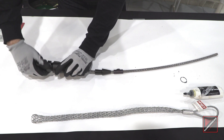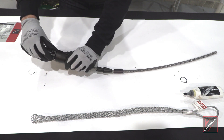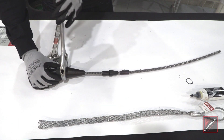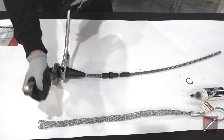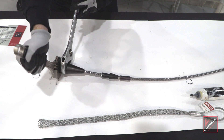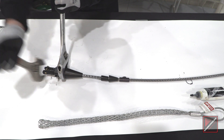A lot of guys in the field like to just hand-torque this — I highly do not recommend that. You do want to get two wrenches on this and torque it down until you get rid of the gap between the nut and the body. There are two flats on the sides of the expander cone — put one wrench over those. The nut itself is a hex, so get the other wrench on there. Keep twisting until you see those two surfaces connect, and now you're torqued.